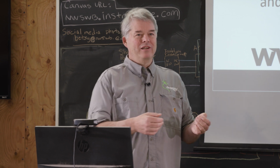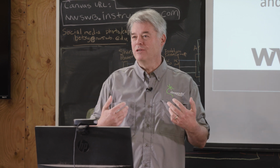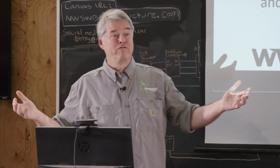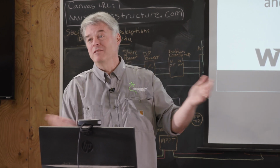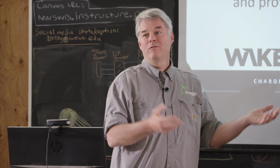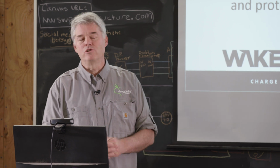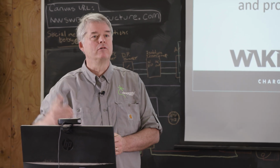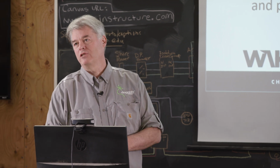Now, unfortunately, the deficiency with a 12-volt system, we talked about this a little bit earlier, is I could be at anchor for 4 days and not run the generator, but I had to run the bloody engine for 8 hours to charge those batteries because I had the 12-volt system. Well, if I had a 48-volt system, I'd only have to run it for an hour. My batteries would be fully charged every time we moved. So there are real-life examples.